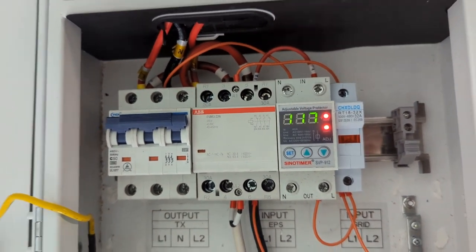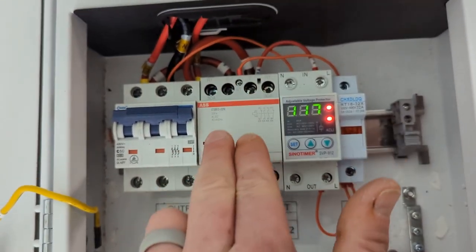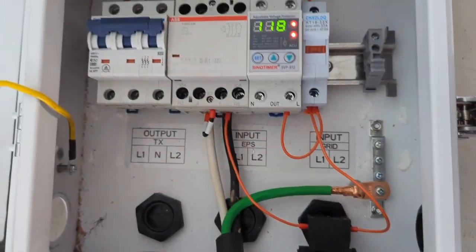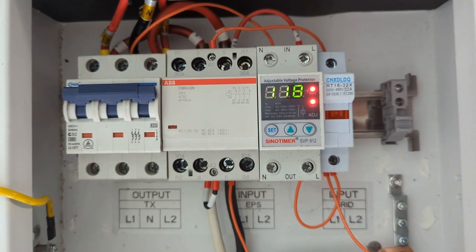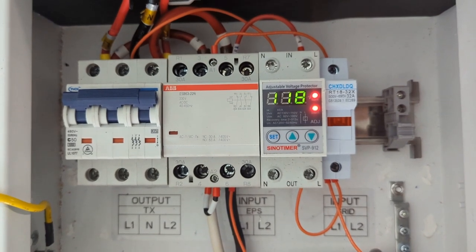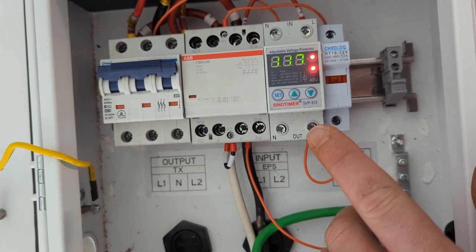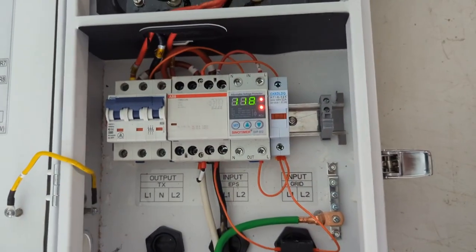Now if there was a neutral fault the whole thing would shut down. What's a little different here is it's going to kill the input side of the contactor so no current can make it through and out to here. The only thing you have to really worry about is just pushing this button. If you want to leave this case closed or just want the most simple setup humanly possible, this is it — the most simple circuit I can come up with using readily available parts. The only thing is I can't really turn off the input using what's in the box, so you'll need an external breaker if you want to put it between the Growatt and the input.